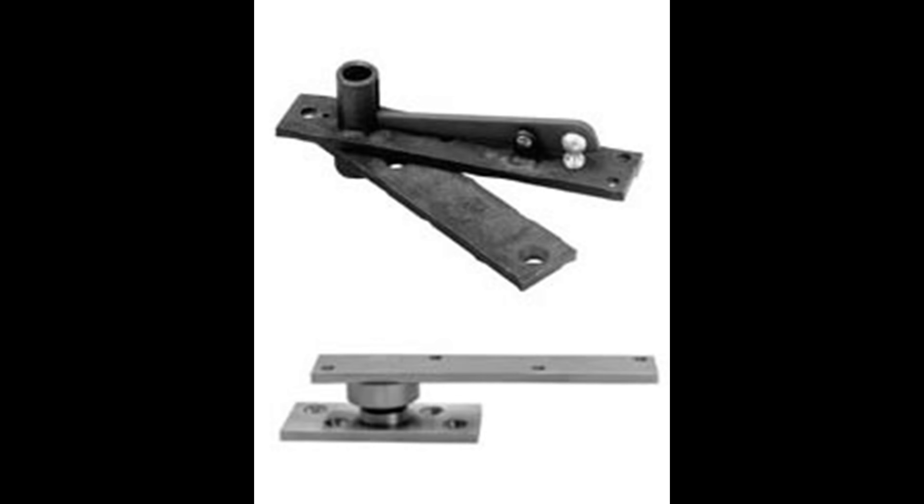You're going to nibble into that drywall face a little bit for the hardware, but your screw's not going to go through there. When the door is open, you would see that condition. You could probably do a situation where you bias the pivot towards the push side as much as possible, which will give you an odd position of the vertical axis of pivoting. But a combination of that and half-inch drywall could put you there.